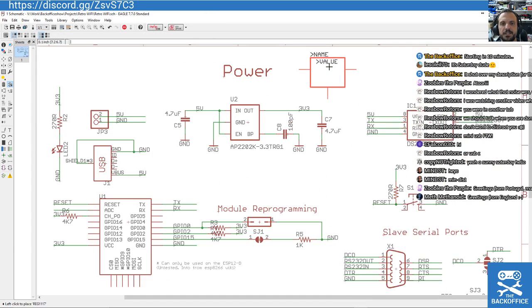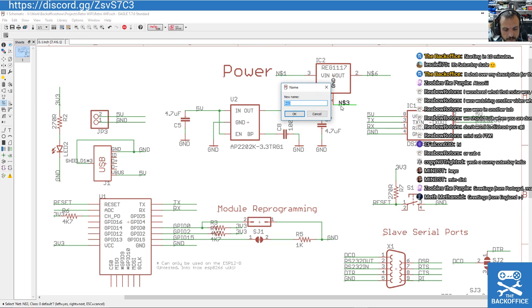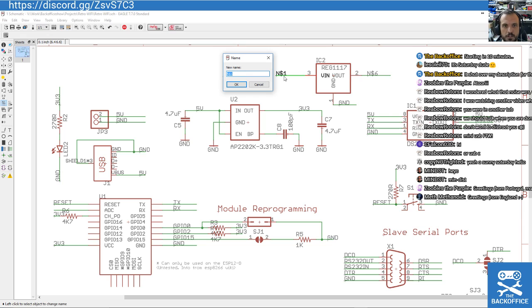Bang. So I've got to relay the power supply ever so slightly. I think there is a function here to change the ends. Or just don't bother. Right, so the V in, ground, V out. So we want a 3v3 regulator here. If you're specifying it, we're already at 5 volts. We only need 3v3. Get your ground in, get your 5 volts, 3v3. And if you fancy it, you can keep hold of all those caps.